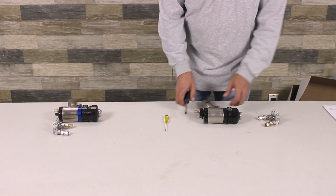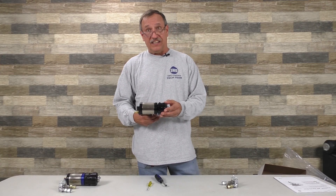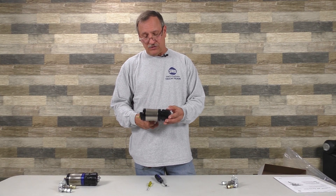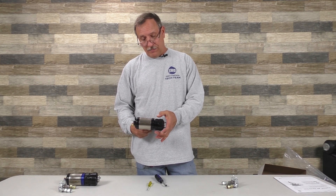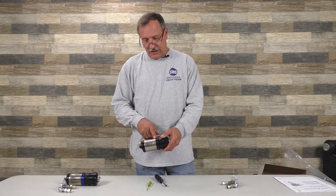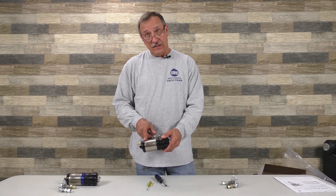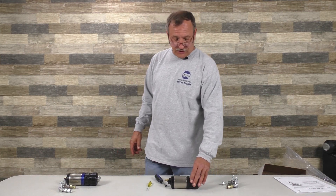The main problem I find with this gun is when you're spraying and you hear a clicking or popping sound every time you pull and release the trigger. What's happening is material is building around that mixing chamber. When it builds around the mixing chamber, it causes a bind up. The air comes up to push the piston, it gets so far and pressurizes until it finally pops back, and when you release the trigger it pops forward. When you hear that, stop, look at your mixing chamber, and clean it.